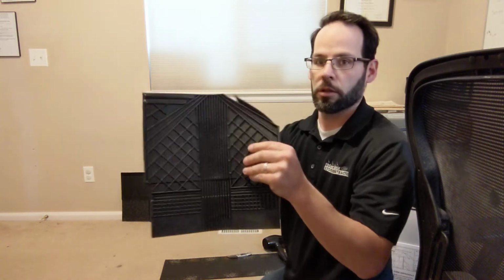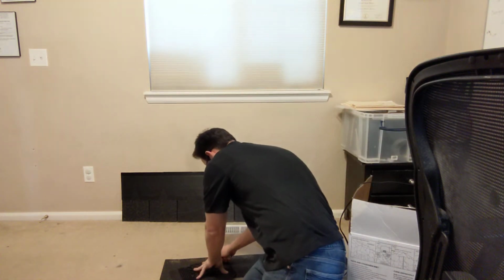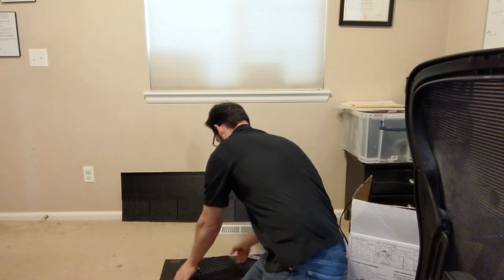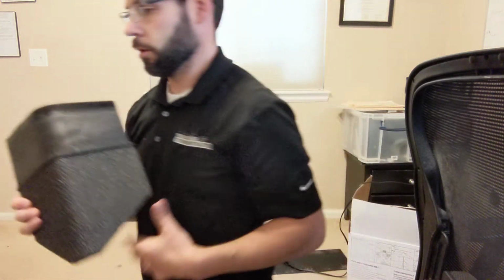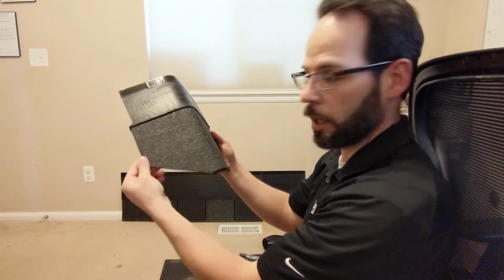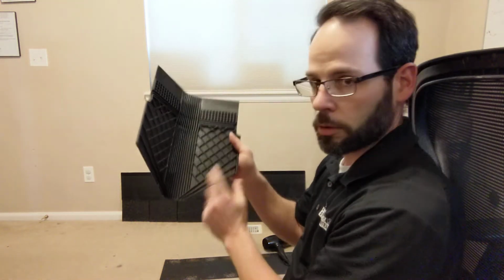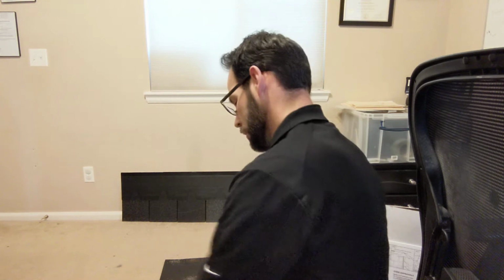So, again, just cut right along that line there on both sides. And when you put that towards the bottom of your hip, you've cut it at exactly the right angle for that pitch. So that's a really nice piece of technology there for the guys. The fact that it's so easy to cut makes it really nice. Shows you exactly where to nail it on the shingle itself. Super nice.